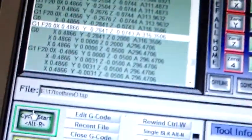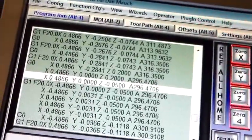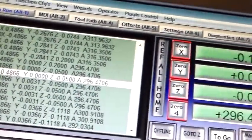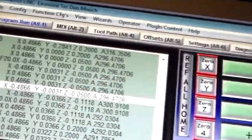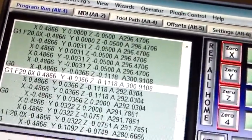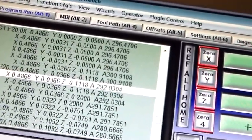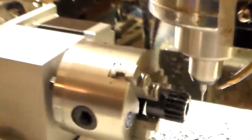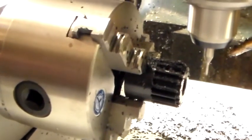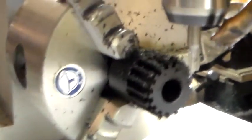While I'm at it, I want to show you the G-code that it's running. When it hits to this line here, the next line — you'll see that the A axis rotates really quite slowly. And the reason for that is it's seeing the F20, which is 20 degrees a minute. So it's going to rotate really slowly, and it's fairly perceptible. You can see on my dial that it's rotating really quite slowly.